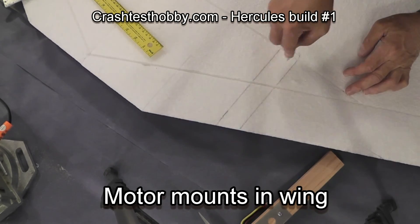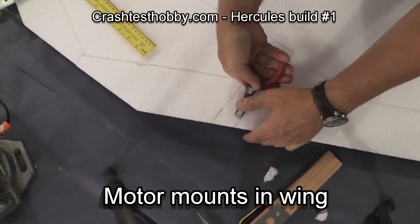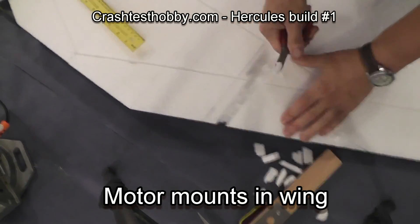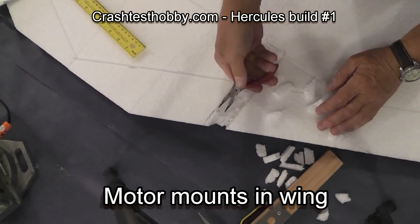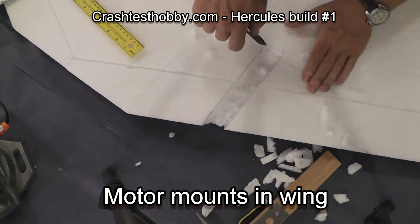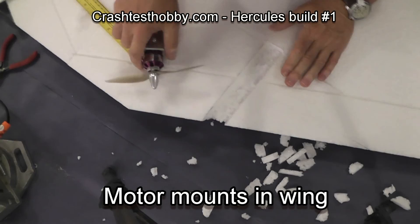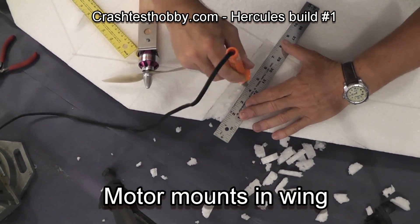In this case we're cutting with a razor blade. I'm going to remove from the other direction and show you another option. After I'm done pulling the foam out I'll use my soldering iron to square up the corners to get as close a fit as I can. We don't want to have to use any more glue than is needed. Once again, make sure the motor block sits slightly under the level of the surrounding foam.